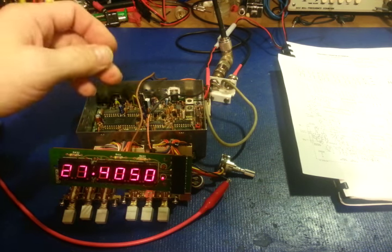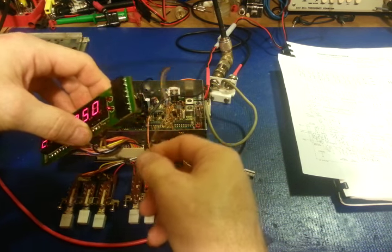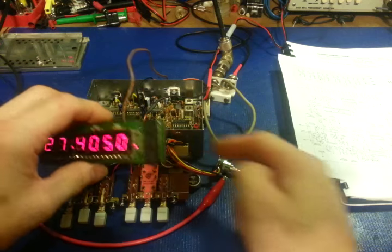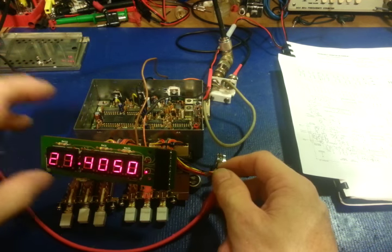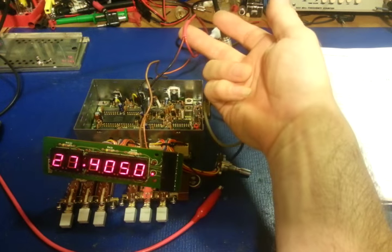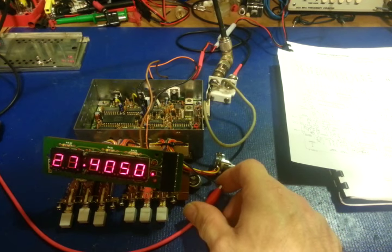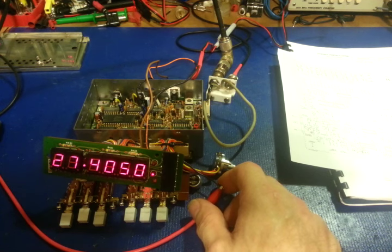There is a power and ground wire. So here's one wire goes over, and this is actually jumpers over to that other plug. And we also have it picking up the ground right here. And then we also have an 8-volt switching. So right now I currently have this running off of two power supplies. I'm feeding it right here to the main plug the normal 13.8 volts. But you also need an 8-volt, which is your normal transmit switching circuit inside the radio.